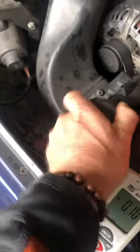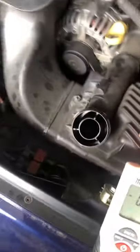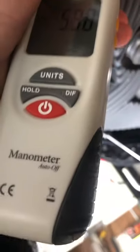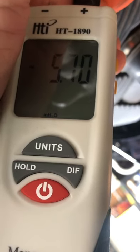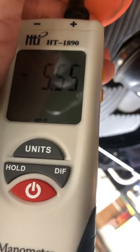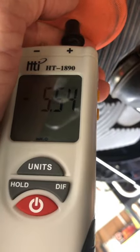You're going to take your cap off and you're going to hear the engine drop. I'm going to put it over top and that's my reading: 5.6. So it should be 4.0 to 6 inches of water.